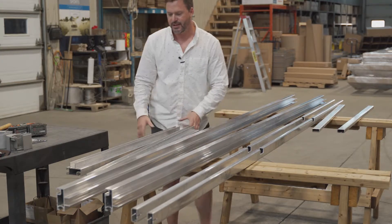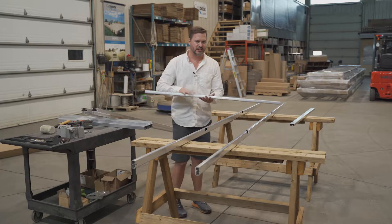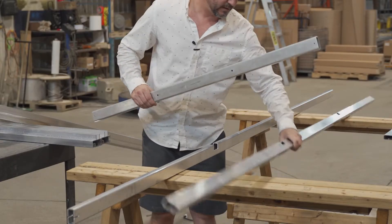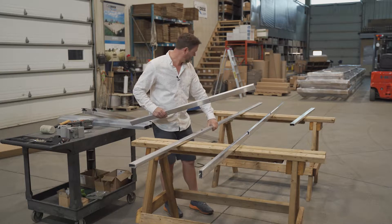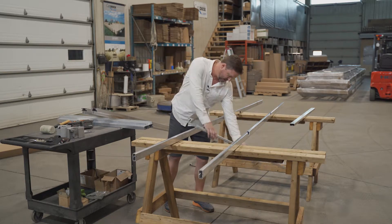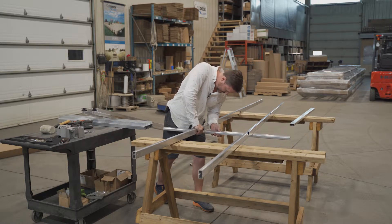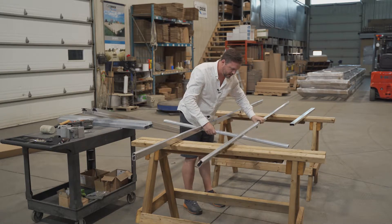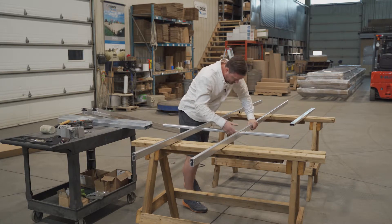You're going to have the inner part, which are 2x1 pieces, and we're going to start with those. Put the extrusion on the side — you notice there's a notch here, and this is for the 2x1 to go in there. There are holes and you can see there's a little hole underneath that's going to match. In order to make it easier to enter because it's a little snug, I'm going to put it backward and just press to make the aluminium bend, and it will fit right in. Do the same thing on the other side.